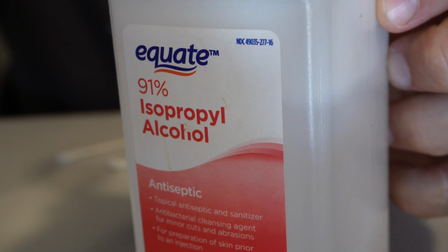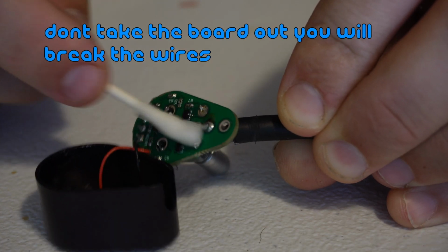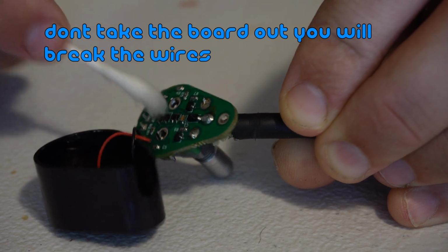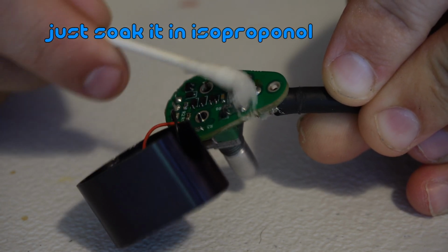I think this has also shown that a small amount of moisture leaking into the mic is not going to instantaneously destroy the microphone. And so if that happens, I would recommend powering the microphone off, opening it up as I showed in the video, allowing it to dry off, and I might also recommend cleaning the board with the purest isopropyl alcohol that you can buy to prevent any salts from forming and potentially corroding the circuit board.